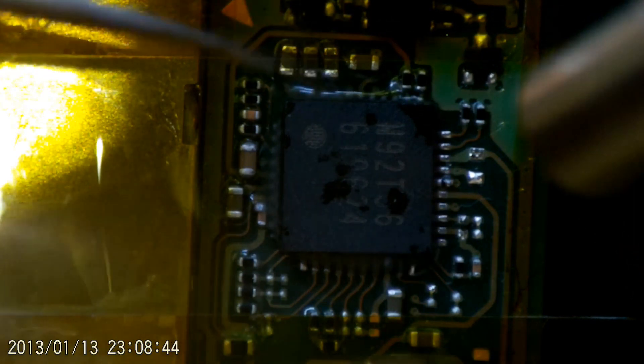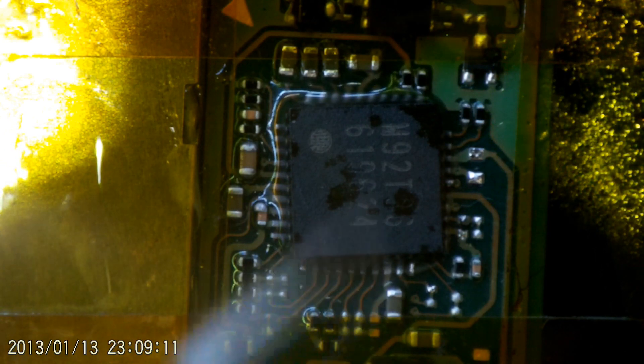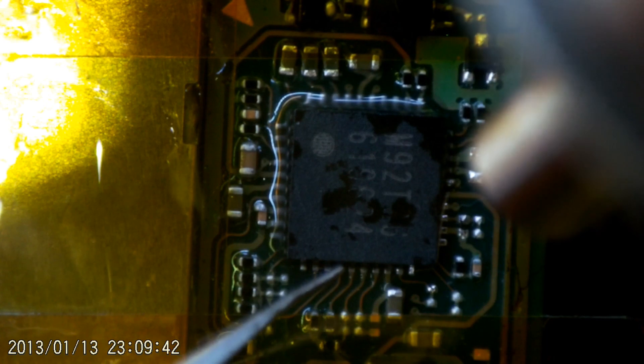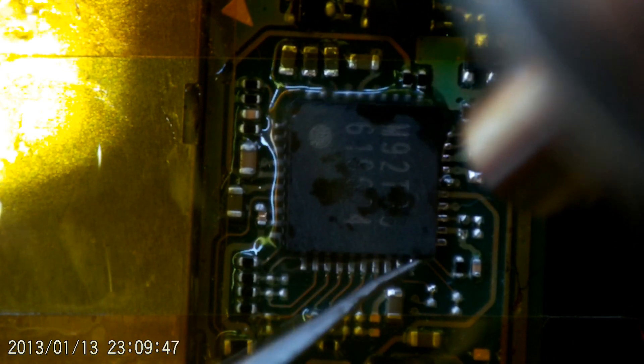One thing I noticed with quite a bit of experimenting was finding a good temperature to get the factory solder to turn back to liquid. I ended up having it at 260 degrees with airflow set at 60 on the Quick. With that, the majority of the time I could get the solder to liquify without blowing chips off the board or pushing the IC around too much. Anything below that I couldn't get it to liquify. I tried 280 at 40, but there wasn't enough flow to heat the solder. I wasn't really wanting to push past 300, so 260 with a flow of 60 — you should be able to take this chip off relatively quickly and reinstall the new one hopefully relatively easily as well.